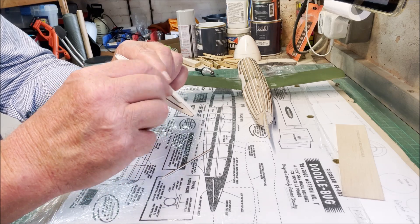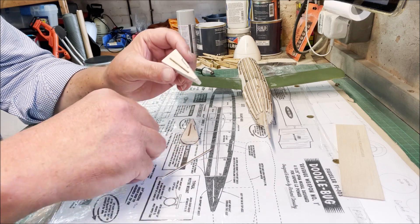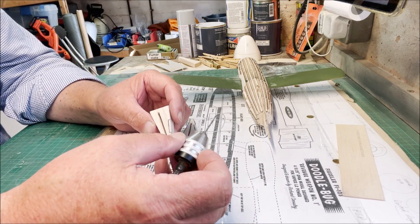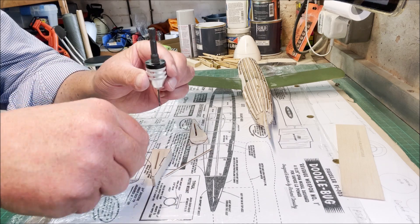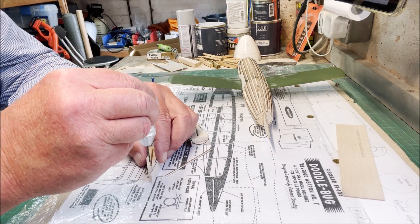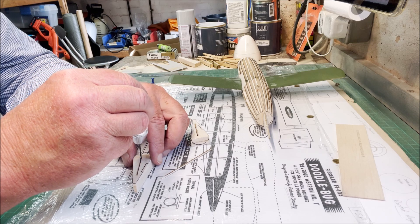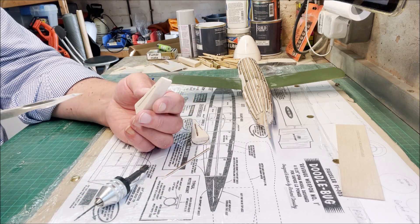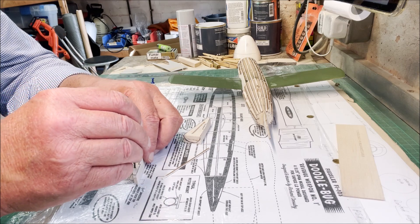How do I get these slots to line up? Because I've already got a line drawn on it - see all the lines there. I got hold of - you can use a 1/16th drill or you can use a 1.5mm; 1.5 is the nearest you're going to get to 1/16th. Put this into the pillar drill - the pillar drill won't accept a drill bit this small so I've got an adapter. I know I've drilled that in absolutely vertically, which is important. If it's vertical you know it's going to come out the right side, the right size, the right place the other side.